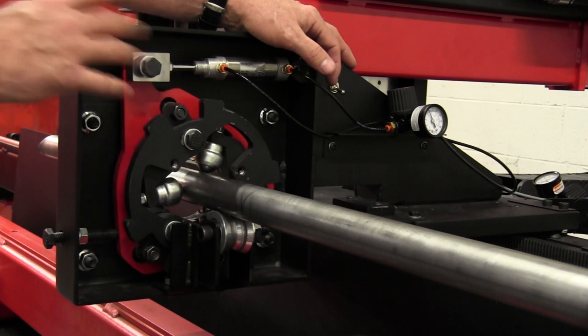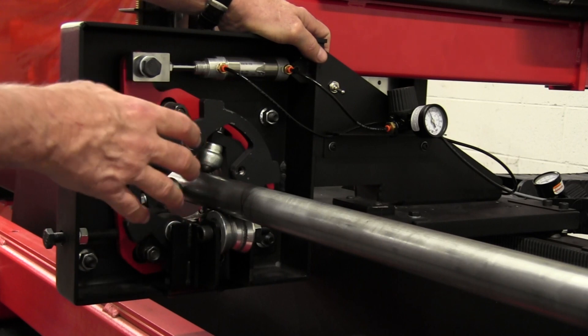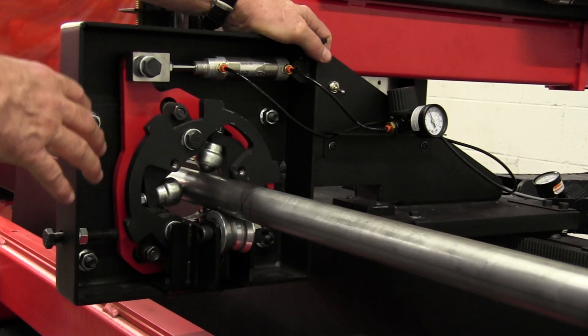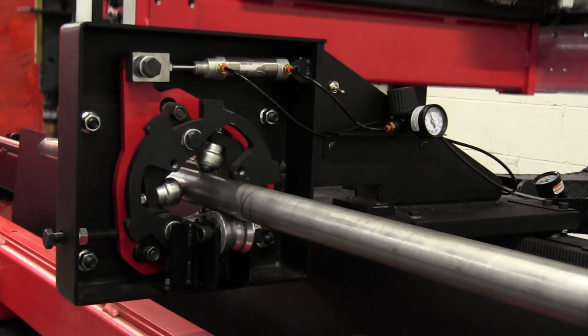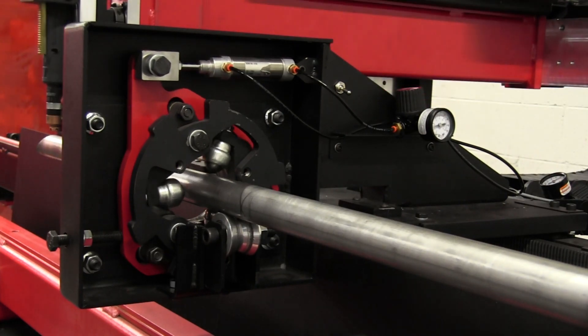The mechanism can be removed if you're doing two-by-four or four-by-four square tubing, where this system clearly won't work. As mentioned, transfer ball systems work well up to three-inch tubing — anything beyond that is just a train wreck. We don't want to sell you a machine that isn't going to last because of that limitation. Let me hit resume here — notice the switch is in the down position, so it will run fully automatic.